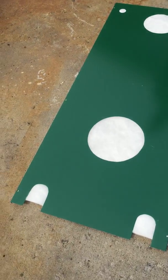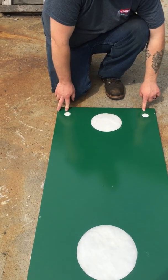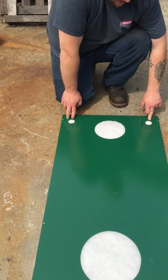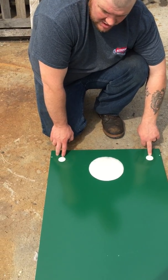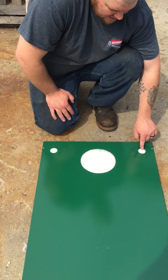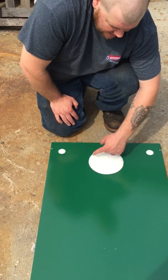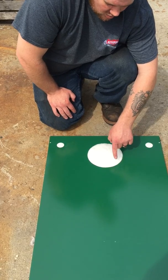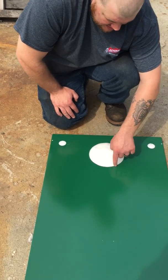And then over here is our final piece. You'll notice we have two holes up here, which are for your half-inch fittings for your fill. On this one, we use this one for the fill and we plug this one. So we'll cut an X out on this one for the fill. And then this is for your domestic coil. Again, what we'll do there is we'll trim that out along the seams here.